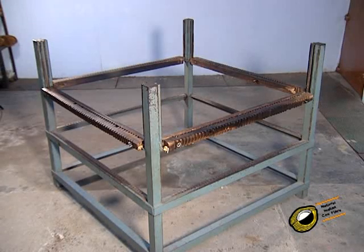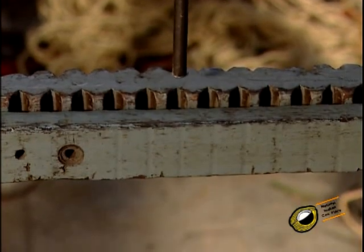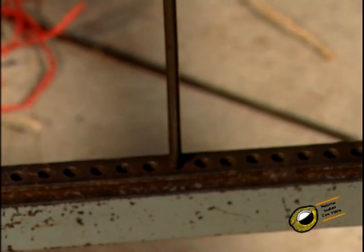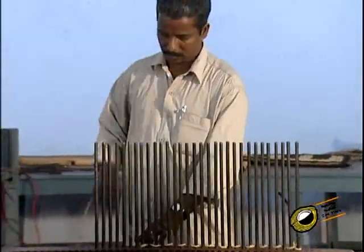The corridor mat requires a wooden frame in which iron rods can be kept vertically through grooves cut on rails to the thickness of the iron rods. The iron rods temporarily function as the warp and the number of ends per foot is 14 by 15 to 18 by 19. After arranging the rods, the weft yarn is passed in between the rods by hand alternately from one end to the other and is turned back.